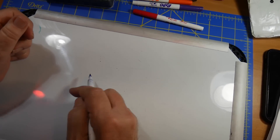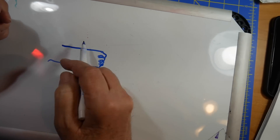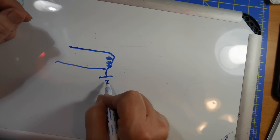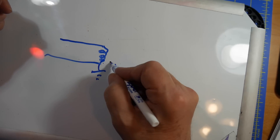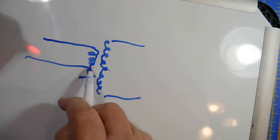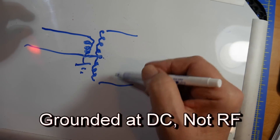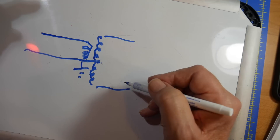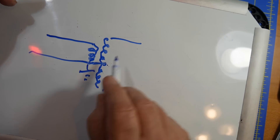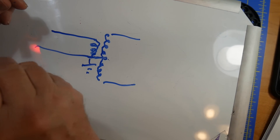I want to show you one other thing you might be able to use to your advantage. If this is the winding on the coax side and this is grounded, then you can create another winding on this side, here and here, and these are connected at the center. If you do that, it's still a balun, but it does mean that this now is electrically grounded. So when you go to your antenna, you can still bleed off the static charge that comes from an antenna in the wind. This is a voltage balun — that's how they're made.